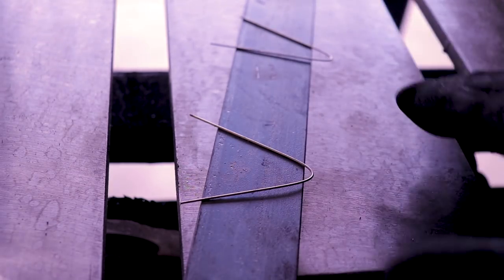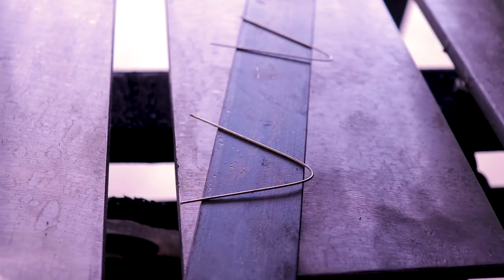So if you're going to be using a fill rod like this as a shim, the good tip is to fold it in half like this, because if you don't, once you put your part on there it's just going to roll around on you.